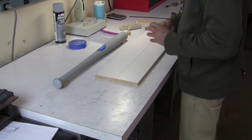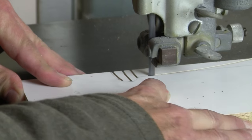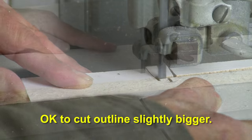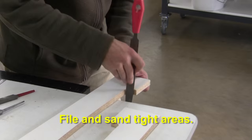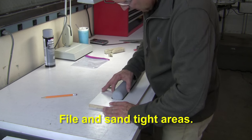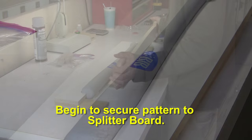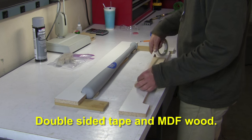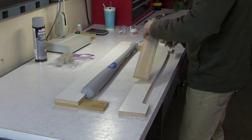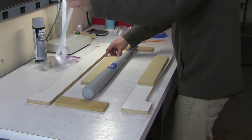When finished, remove the tape and it's time to cut out the profile. Using a bandsaw, we begin to cut along our pencil lines. It won't hurt to make the profile slightly bigger, because we'll use clay to fill in the gaps in a later step. Files help shape the tighter areas the bandsaw can't reach. We check our fit to the bat, and when satisfied, we can move forward with securing the pattern to the splitter board. Double-sided tape and scraps of MDF wood help us create an accurate, level flange area. We've blocked up the pattern with clay to the desired height, and a flat, smooth workbench is also very helpful when doing this type of work.